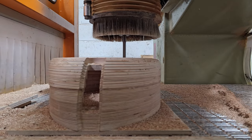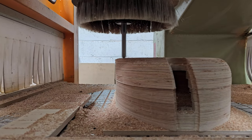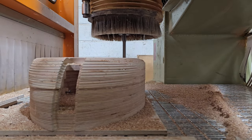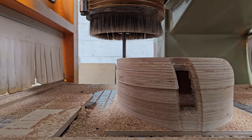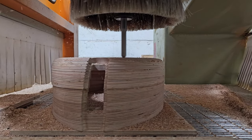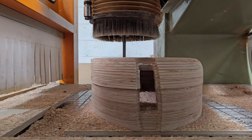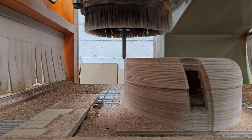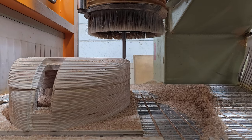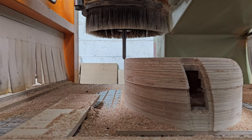So it looks to me like it's completed that. It's a constant cusp tool path that it will have completed, and it's moved on to the horizontal Z contours. So what this is doing, it essentially takes a slice in the Z axis. The top of the model is about 150 mm, so it takes a slice at 150 mm. It traces the profile in X and Y, and it tells the cutter, right, just whiz round that in X and Y. And then when you get to a particular point, drop down in Z a tiny bit, retrace it and whiz round again.